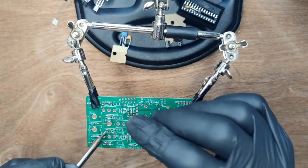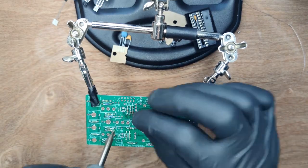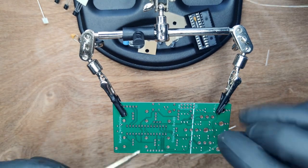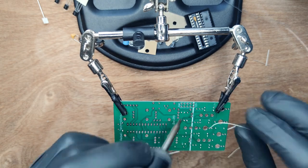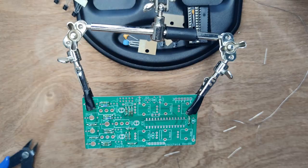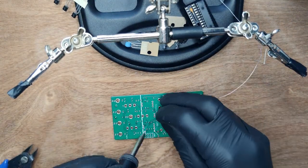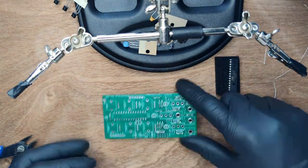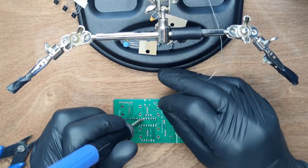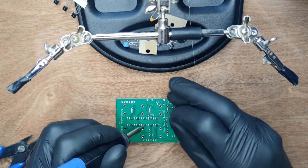When soldering from above, make sure the solder flows all the way through the via. Flip the PCB and clip the legs, holding them down with your thumb to make sure they don't jump up. Check over any soldering that needs extra attention. Then place the single diode, minding its polarity. Next is the IC socket — make sure to orient it correctly, matching the notch to the illustration on the PCB. First solder the two corner legs, then check that it's completely flush with the board before soldering the remaining legs. You can rest the PCB on a piece of foam to keep the socket in place while you solder.